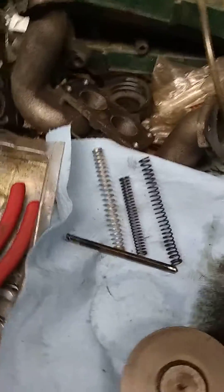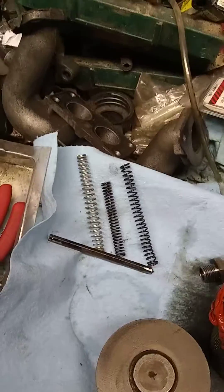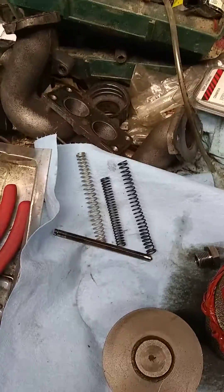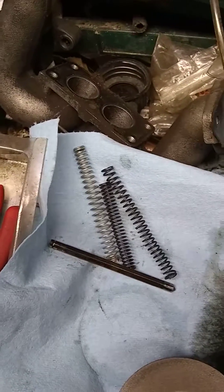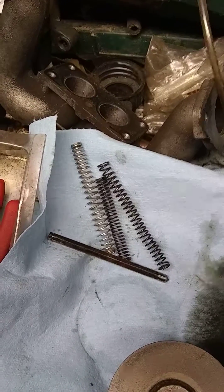Hey people, this is Miller here. If you want, you can like and subscribe. I'm currently working on a Ford 601 Workmaster which I'm fixing to show you. I'm showing you the springs, and you've got to watch it — sometimes these hex drives on the bottom of your distributor will accidentally come out and drop in the oil pan. This is a 1958 Ford 601 Workmaster.